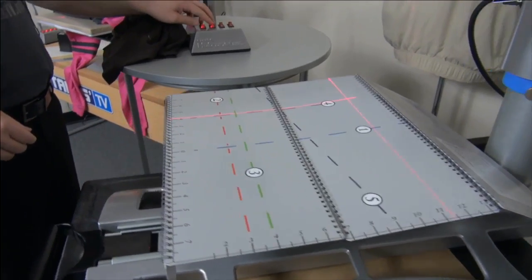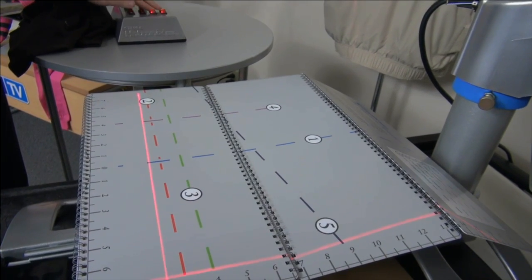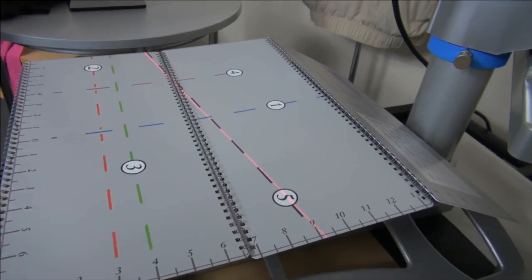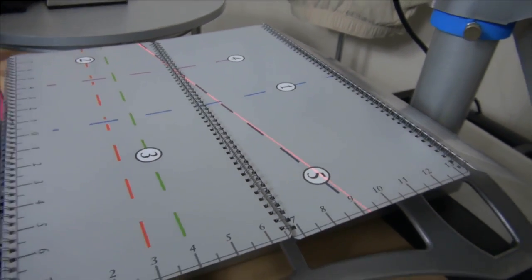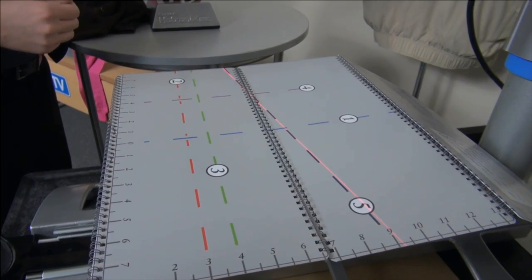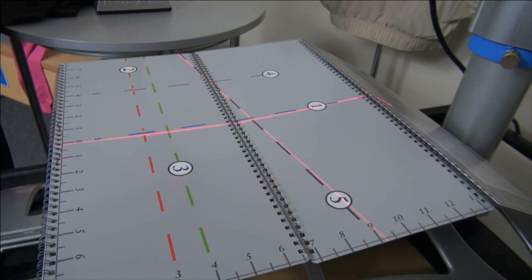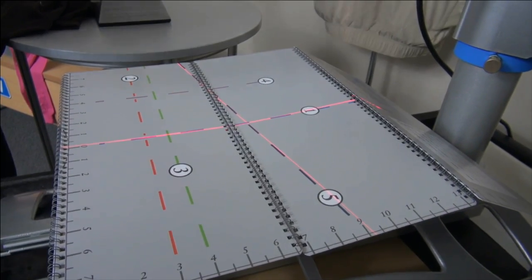I'll flip it on. We're going to do a script with tail, so I'll grab the closest laser and dial it in to my script with tail placement — see how I'm adjusting it here — and once I have it in position, lock it in. Then I want the closest one to my center line, take that one, bring it down to the center line so I can find the center of my script with tail, make a quick fine adjustment, and lock it in.